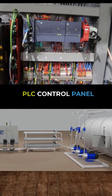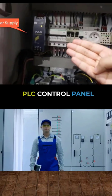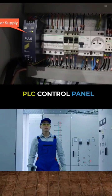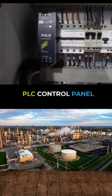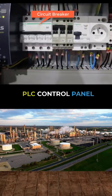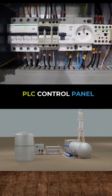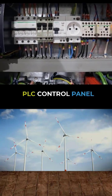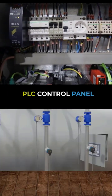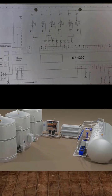Apart from that, if you can see here in this panel, we have a power supply. This power supply — you are already aware — is used to power up all the devices in the rack. Apart from it, you can see these are circuit breakers. If the power is coming from 220 volts, it has to pass through that, and then it is going to the power supply or any other device operating on 220 volts. So this is how it looks when you talk about the S7-1200 PLC rack. We have checked our PLC panel.